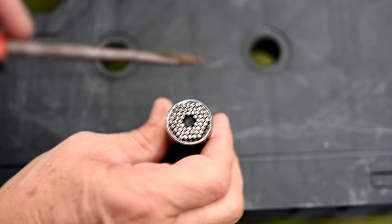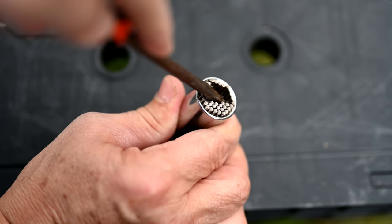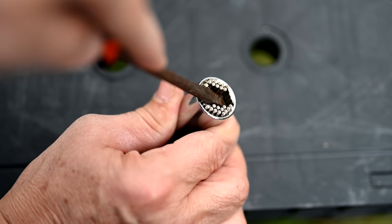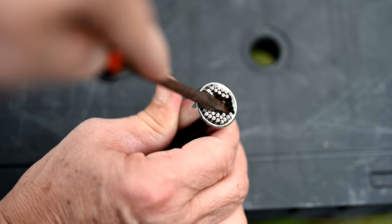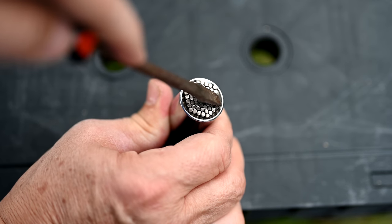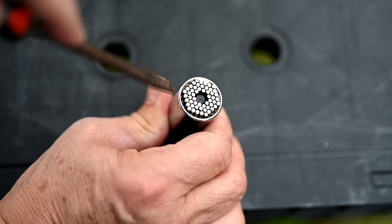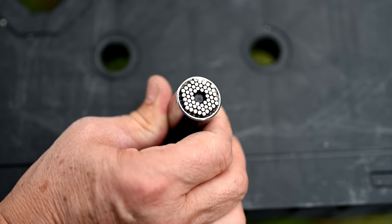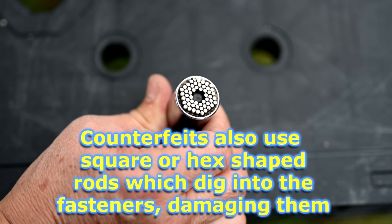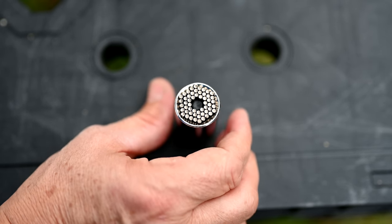I want to show you something a lot of people may not have noticed. I'll push down some of these pins with a screwdriver — see that scalloped edge? Each of the hexagon sides has a scalloped edge. Those scalloped edges keep the rods directly in place so they don't wiggle and can transfer torque to the fastener. The cheap knockoffs don't do this — their rods are all over the place, causing poor fit, and they often break due to cheap steel or white metal instead of high-end stainless steel like Endeavor uses.